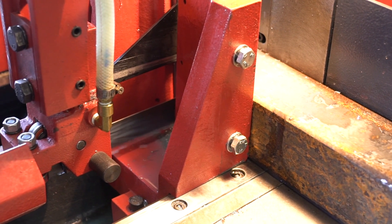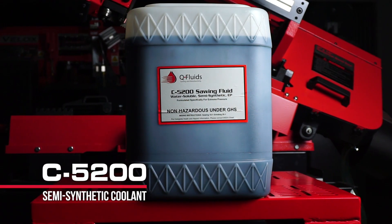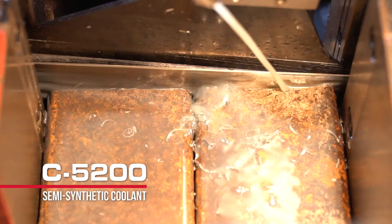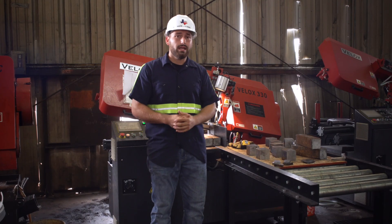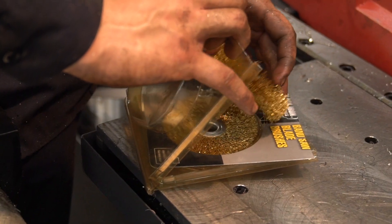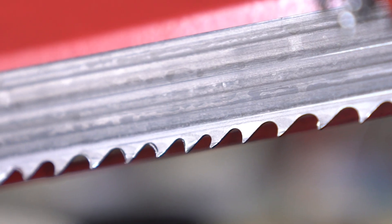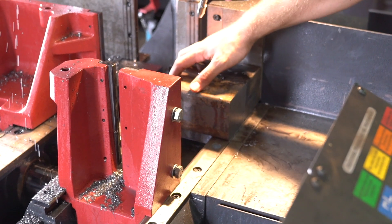When cutting an abrasive cast material, you're going to generate a lot of heat, just like you do with stainless. So we're going to be using SawBlade.com's C5200 semi-synthetic sawing fluid. The C5200 is a great sawing fluid that we use in every machine here in the shop — it's got a good detergent package and good lubricators, and it's going to keep the part and the blade cool and clean throughout the entire cut process. Another thing that helps keep the blade clean is the use of a chip brush — it keeps those chips ejected out of the gullet as the blade travels through the part, helping to prevent blade deflection, keep teeth on the blade, reduce tooth stripping, and ultimately protect the customer's parts and blades.